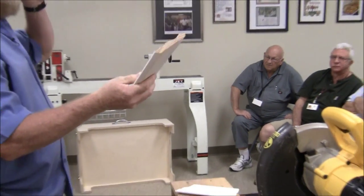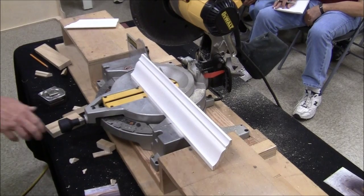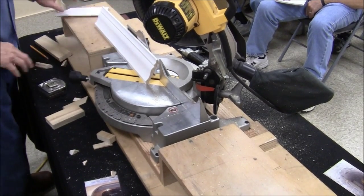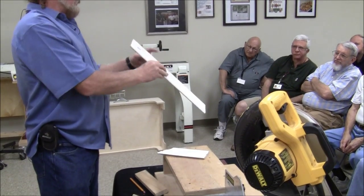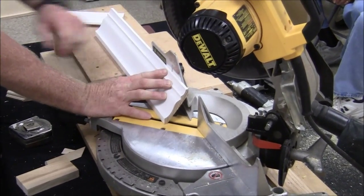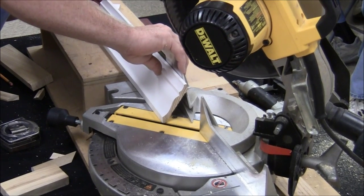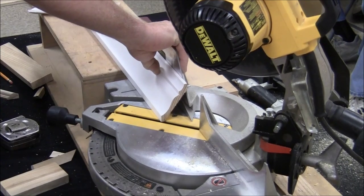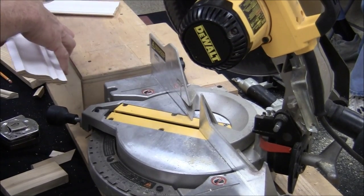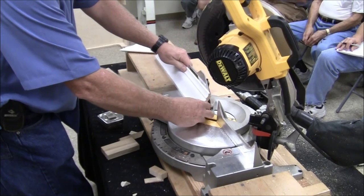Any time you're cutting whatever molding it is, you have to cut it in bed. With crown molding, you basically cut it upside down in the box. Everybody knows on the back of the crown you've got flat spots on the bottom and on the top edge. So when you put that in your miter saw, it should sit completely flat against the fence and the table. Once you've got it set up and you know what your rise and fall and run is, you can go ahead and run your pencil mark on your box. I don't like to put a block of wood down across, which keeps the crown from sliding, because then you can't make adjustments — sometimes you want to roll that crown molding in or out a little bit to adjust your cut.